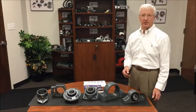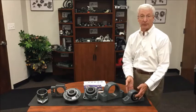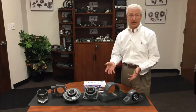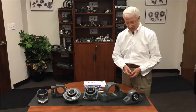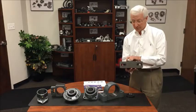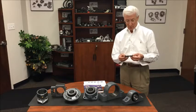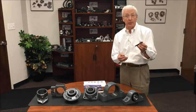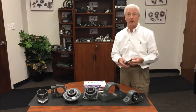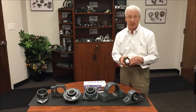There are three key features I'd like to point out on the spherical mounted roller bearing product. The first is that the housings are all ductile iron for added strength — significant over the standard cast iron that's normal in the industry. The second is that all of the bases are solid, again for the most robust housing in the industry. The third key feature is the HNBR seal, which gives a temperature capability up to about 290 degrees over the typical Buna-N material. The lubricant also has that capability, so they're perfectly matched for higher temperature operation.